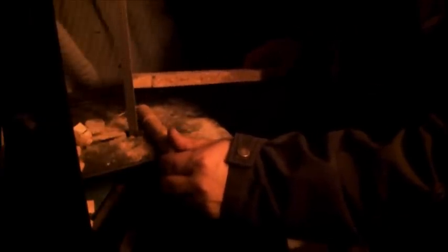Now you'll also notice, as I go forward with this cylinder, round tube shape, when I'm addressing it to the blade, I don't just do a straight push. I actually roll it under control. Whether it's the right technique or not, I find it doesn't jump as much if you actually advance it into the bandsaw like that. The bandsaw actually is trying to make it fight this way, so I find this less chance of the blade jumping about.